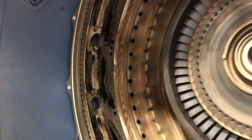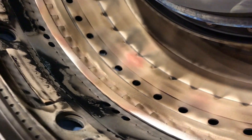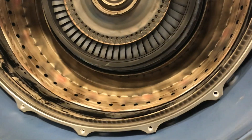These holes are for letting oxygen in to be burned but mostly for cooling. There are many different iterations of these cans — different numbers of cooling holes, different shapes, different coatings. This one has a ceramic coating. This is the outer can, and the inner liner is right here on the bench. We haven't bolted that in just yet.